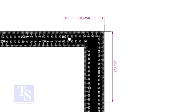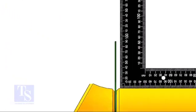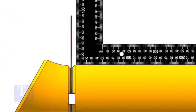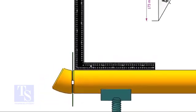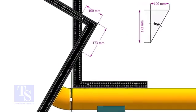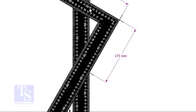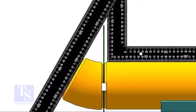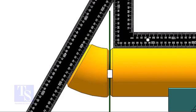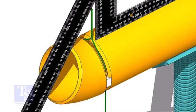Mark the sums of the multiplications on the right angle as shown. After tack welding on both sides of the joint, hold another right angle on the edge of the pipe. Put the right angle on the face of the elbow as shown. If required, turn the elbow vertically to match the marking and the vertical face of the right angle on the pipe. Make sure the edge of the right angle touches both edges of the elbow, then tack weld on the top and bottom side of the joint.